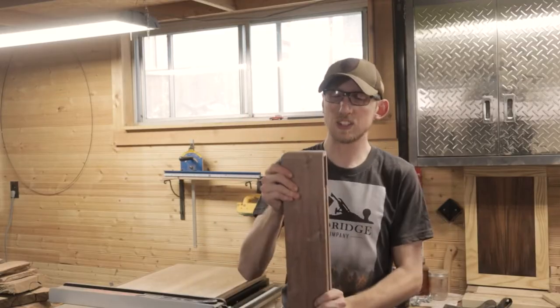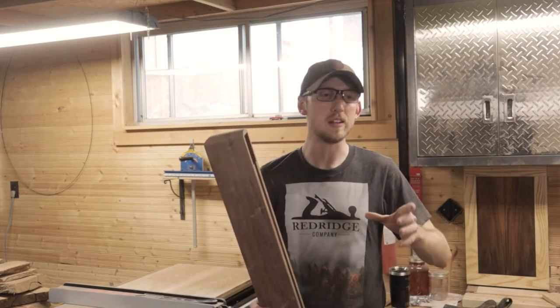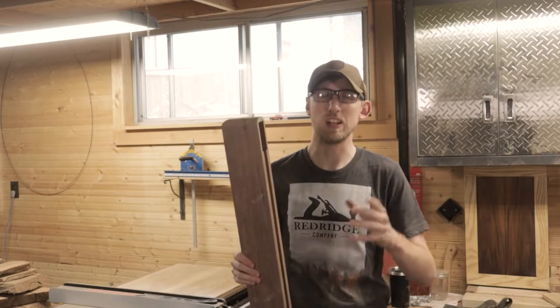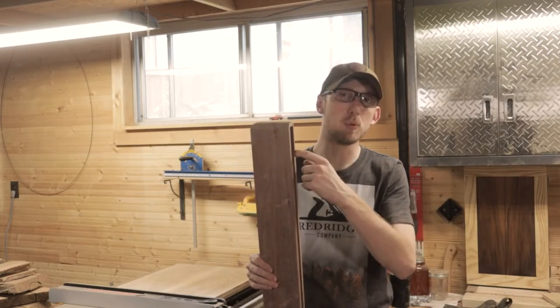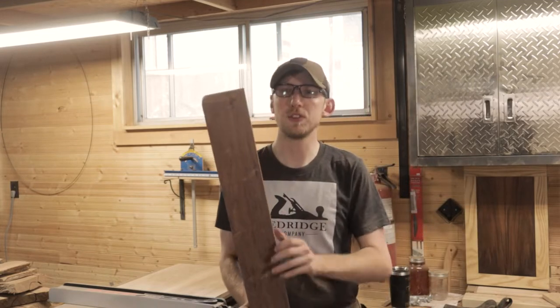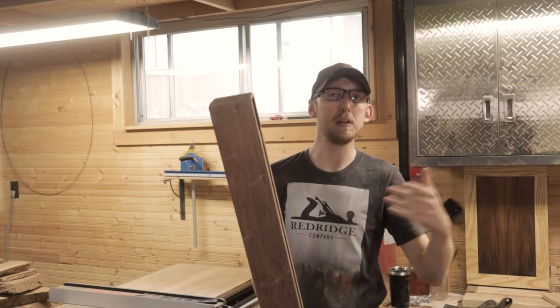Our dowels are actually very important to add in, even if we didn't need them for the glue up, which they're just gonna be super helpful during. This kind of construction, it's pretty necessary to do something with these mortise and tenon joints to make sure that they can't come apart. Just the way that this bed is built, there's a good chance that these joints will be in tension.